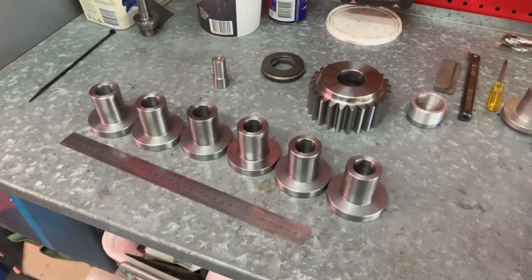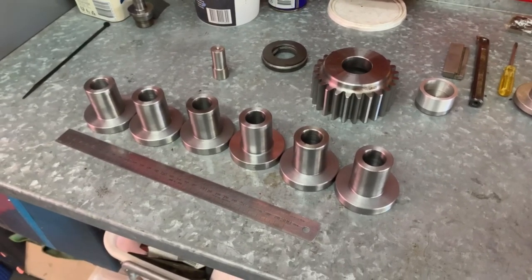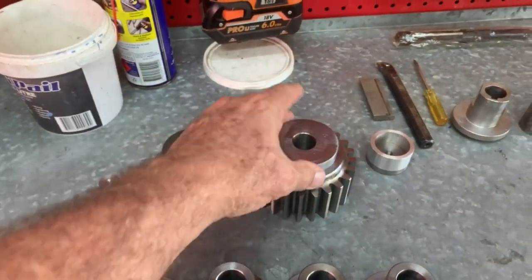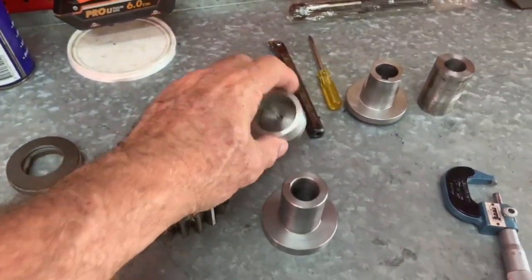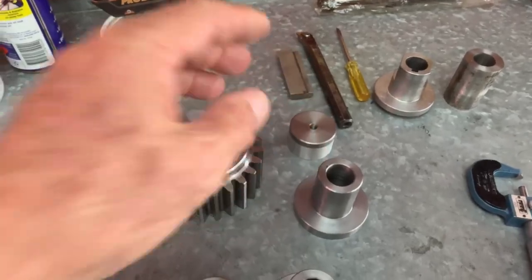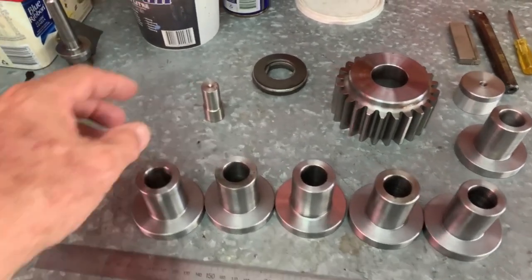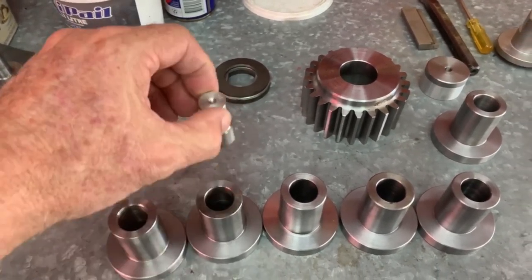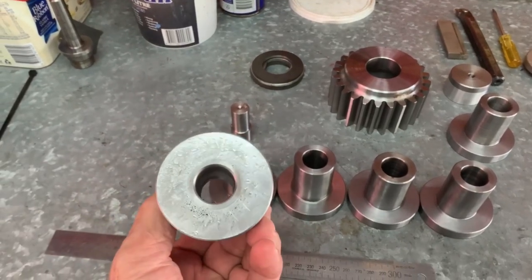I have an interesting little project underway here using the Myford lathe, machining up these bosses or hubs which are designed to go inside that gear — it has to fit inside there but in reverse. On the other side it has to be a reasonably snug fit. Also making up these cups designed to slide over the top. This is out of an automatic door mechanism — we're making a manual override for a commercial automatic door. This test piece ensures the shaft fit is spot-on, and they've come up really well, properly manufactured looking.